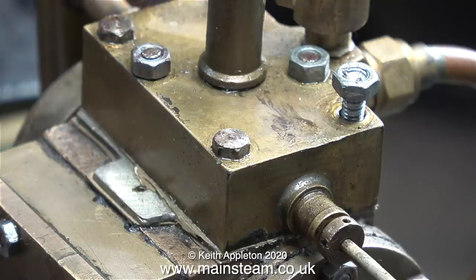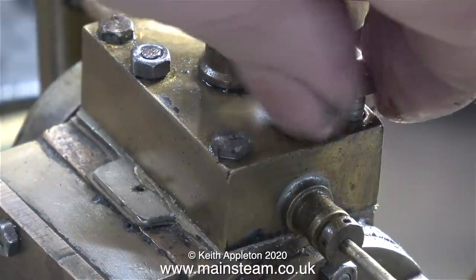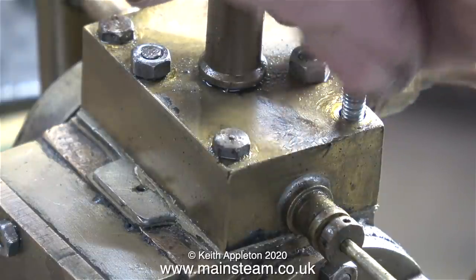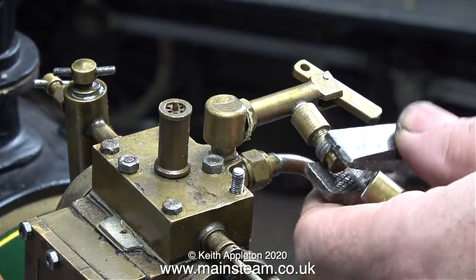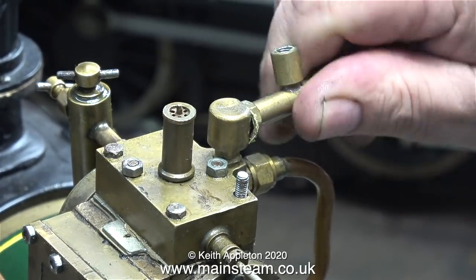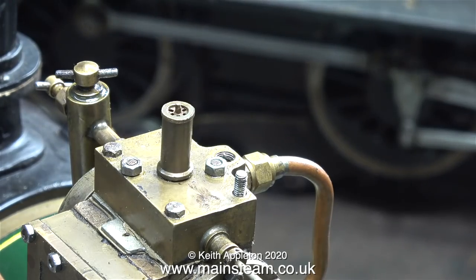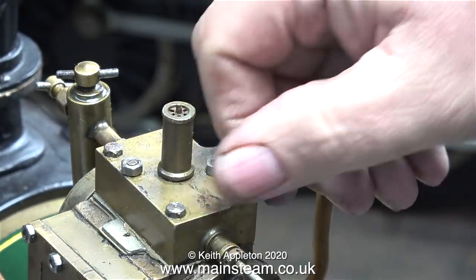This traction engine is obviously nowhere near as old as the beam engine, but it's been bodged about a bit. I would assume the regulator block was originally held to the cylinder using 4BA bolts, but in the past some studs probably pulled out of the cylinder — so the solution has been to use M5 studding and some horrible M5 nuts. This is of course a sympathetic restoration, but that does not include recreating the bodges. While I'm at it, this whistle fitting has to go — there's nothing wrong with it, but it's massively over scale. I'm going to fit a PM Research whistle which will match the size of the engine perfectly.